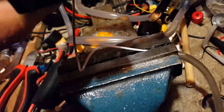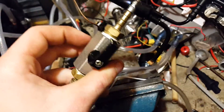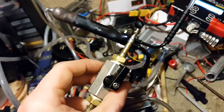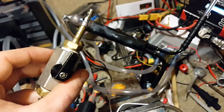All I've done is clamped the capillary tube inside a clear plastic tube, and it's just on a foot pump. All I'm doing is putting the air back through the capillary tube. You don't want to do it the other way, just in case dirt or whatever else gets caught in it and blocks it, making the whole thing useless.